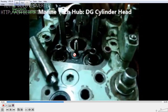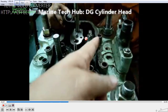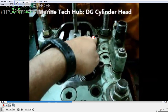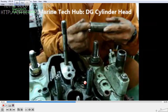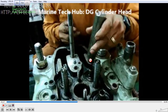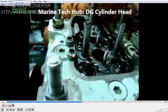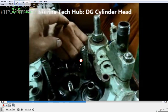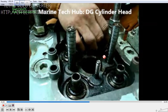Inserting correctly is very important. Punch it correctly — you can see what I am doing. I insert the stem seal inside the tool, then punch it into place. You can see here — I place it in and then put it exactly into that slot. Do not hammer it very hard because it will go too far; just hammer a little bit so that it goes and sits properly.